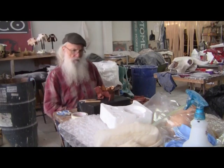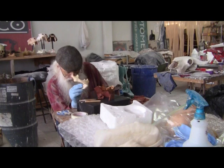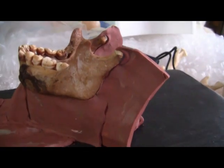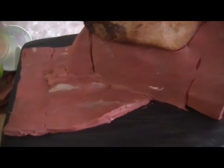Trying to figure out how to best mold these lower jaws here so they won't trap air — trying to remember how I did this one. So I'm going to pull the clay tighter in here and smooth this out with wax; it's too rough and would make a bad pour spout.